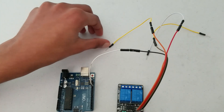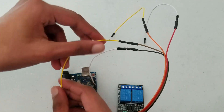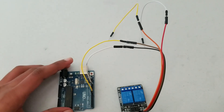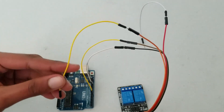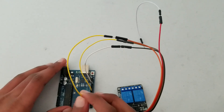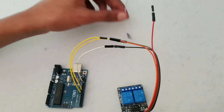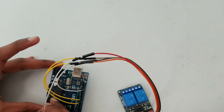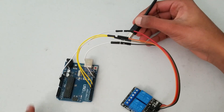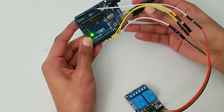The second thing we need to plug in is IN1, and we need to connect that to one of the IO pins. I'll pick pin number 8 — you can pick any pin you want, but this will affect what number you type in when coding the Arduino. For IN2, I'll plug it into IO pin 7. And finally, for the 5 volt, I'll plug it into one of the 5 volt pins. Now I'll plug the cable into the Arduino, and you can see the lights turned on.